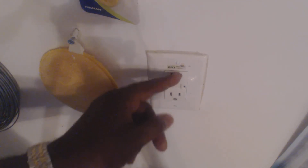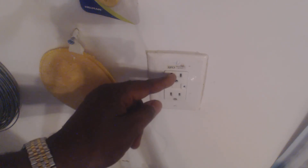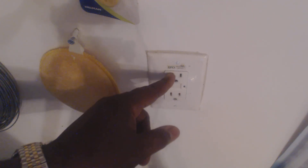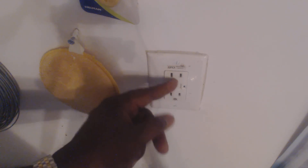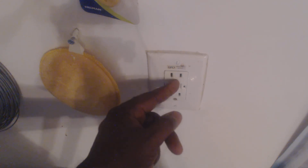This is a ground fault circuit interrupter, so what it's saying is that anytime you have power coming out and you have a short anywhere — even if it's a short from your common to your ground — it's gonna kick this circuit. I kept tripping because in my truck my common and my ground was tied in together, so it was a dead short.